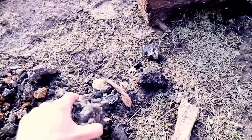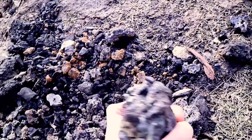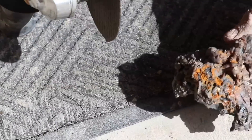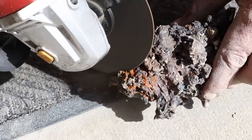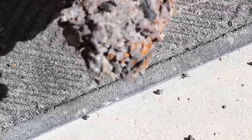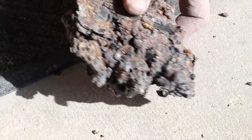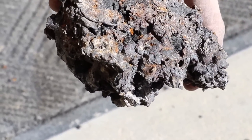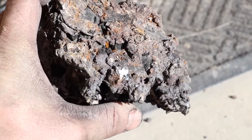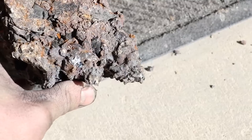This is the leftover of the furnace we made. You can see there is red dirt in all the places that were cooked by the fire. Here is what we're hoping is our iron bloom, and that is looking really promising. We just need to take this back to the workshop and try chopping into it. This is a piece of bloom from the smelt we did — nothing shiny on this side. However, if you flip it over, I ground a spot right here where you can see the sheen of metal. So we know that it's metal — we've made iron here. Success. Moderate success, but success nonetheless.